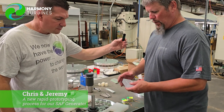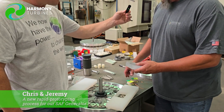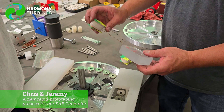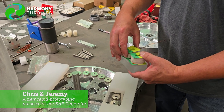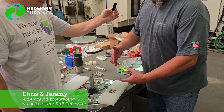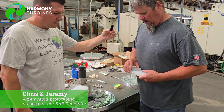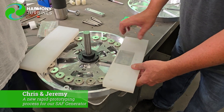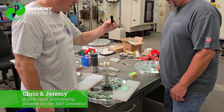So what we did was make another mold. Instead of a large mold with a full-size ring, we just made a much smaller mold. This is a pour that's just epoxy. When we do an actual test setup, we'll take coils like this and mold them into the epoxy — they'll be cast into the epoxy in configuration. Then once the epoxy is set, we take it out of the mold and stick it right here in our coil holder on the test rig. Now we have our spacing correct, just like we would normally have in a full-size generator.